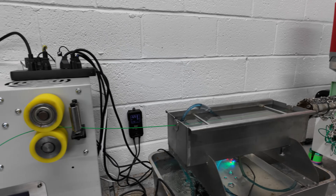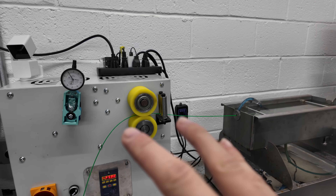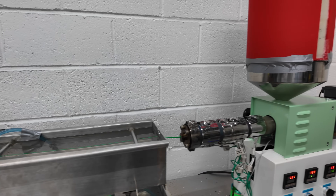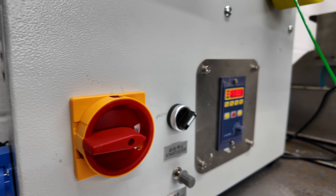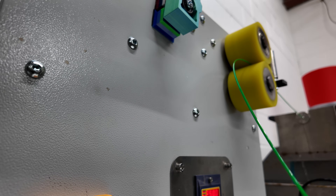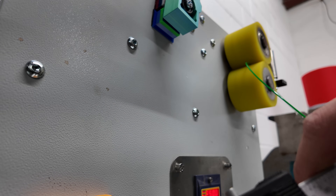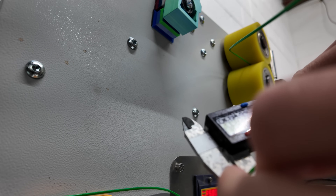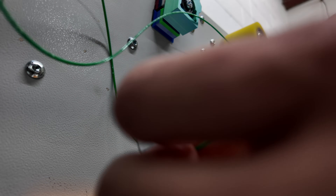You can see it's rolling properly into the rollers. The next step: I let this run for a couple of minutes because I want the temperature of the water bath to be consistent with the temperature coming out of the extruder, so that we get an even diameter of filament coming out of the water bath. I'll take my calipers and manually measure — we're already at about 1.9, 1.8.